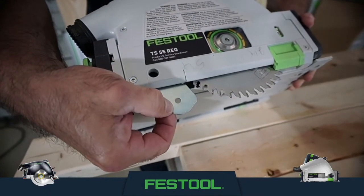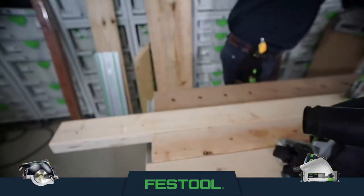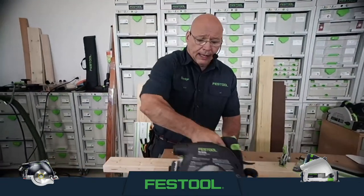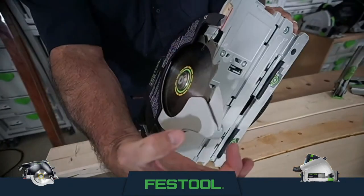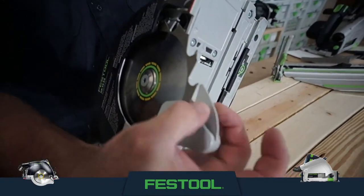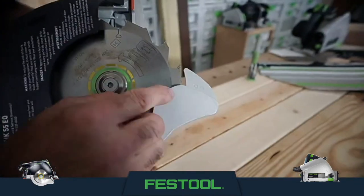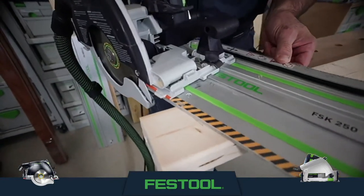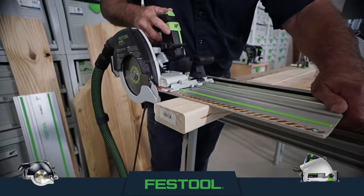That is called a riving knife, okay? And what that does is keep the kerf open when you're cutting case hardened wood, okay? Same thing with this. If I'm ripping with this, this will prevent the blade getting pinched with case hardened wood. And let's look at the number there, so hopefully we can get the light on there. It's 1.8 millimeters thick. See how that's bumping up against there? And I can rotate my other fixed, my variable point in there.